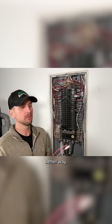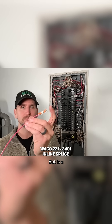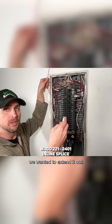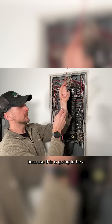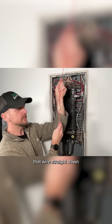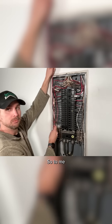This is pretty new to the U.S. market, but it is a butt splice from Wago. So if we had that same hot conductor we wanted to extend, there's no more doubling back — this is going to be a butt splice that just continues that wire straight down, and that's going to be about as small of a package as you're going to get.